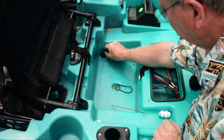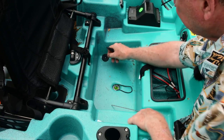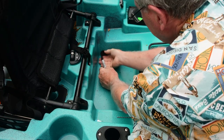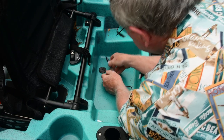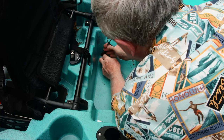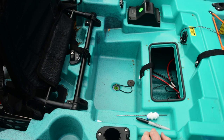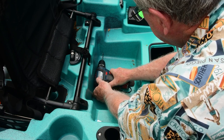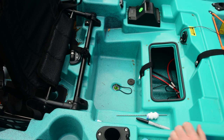This fitting simply makes sure that you have enough room on the backside, that you're not drilling too far to one side, and that it is centered. I'm going to take a magic marker, put it in the hole, place the fitting where I want it, and mark this side. That's where our hole is right there. We're just going to pop a hole right there — that's our pilot hole — and next we're going to grab a hole saw and make our big hole.